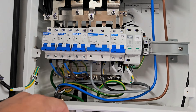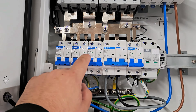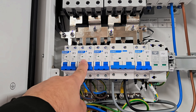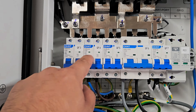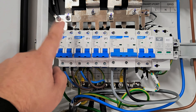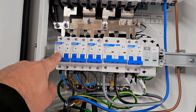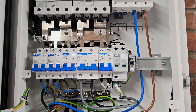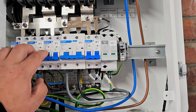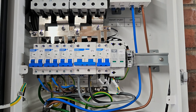One fly in the ointment we had to work around — and I've spoken to SIG Energy about this — is the power for the EV charger. You can use your inverter inputs for this, but we need to swap out the MCB because we need RCBO protection. The backup load has your consumer unit connecting off the common busbar and essentially all of these are doing the same. The other issue is this is a C40, and for our inverter rating that is a little bit on the stingy side, so we also need to upgrade this to something a little bit larger. With this particular gateway everything inside is rated fine for it, but our inverter could trip that breaker when it is charging and discharging.